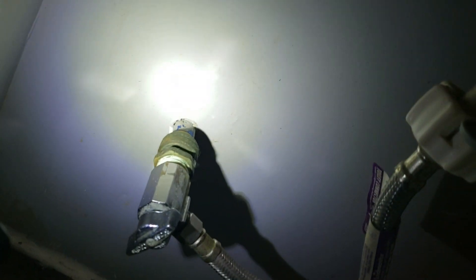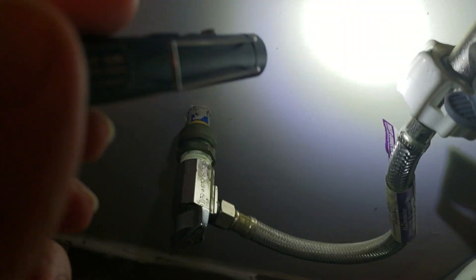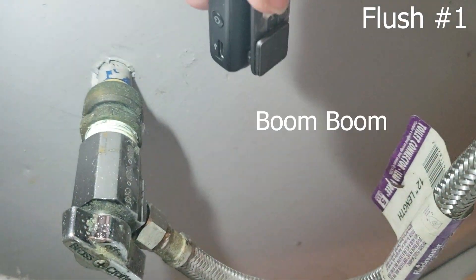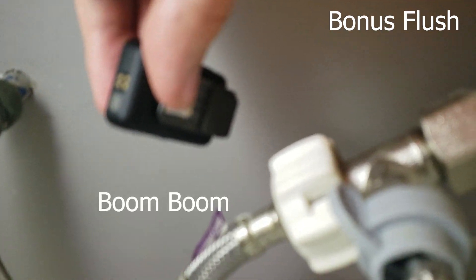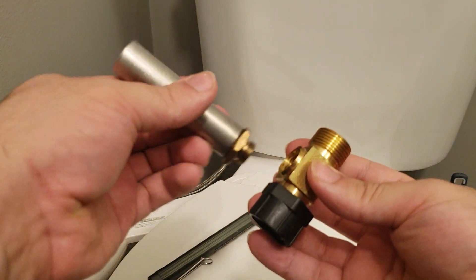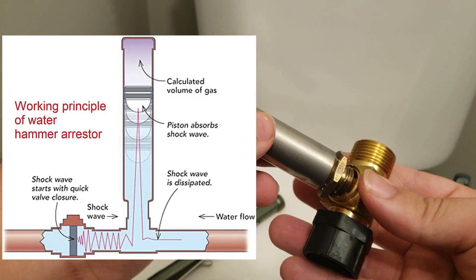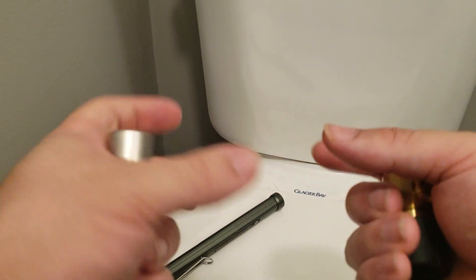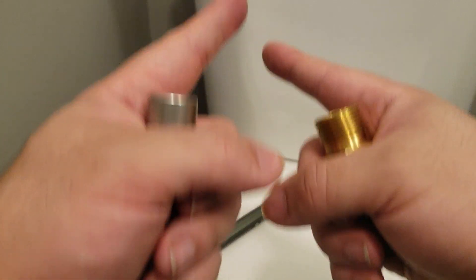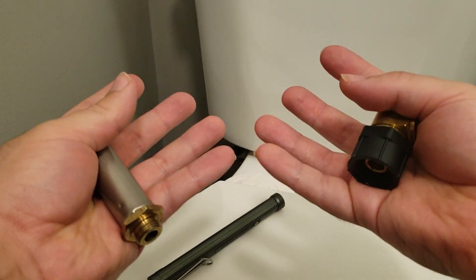Squeezing by the bidet — tight spot. I'm going to turn off the angle stop, making sure there's no supply to the toilet. Make sure it's completely flushed. For those unfamiliar with what a water arrestor is, it's essentially a small piston that compresses the air behind it in order to absorb that shock of pressure. You should have some air in your system — not to the point where you're coughing out air, but certain spots where the water pressure can equalize with air.